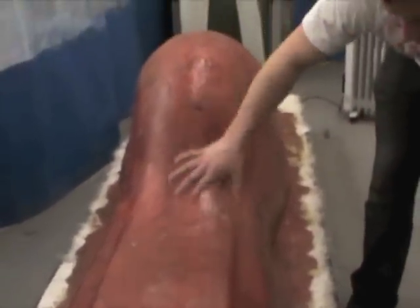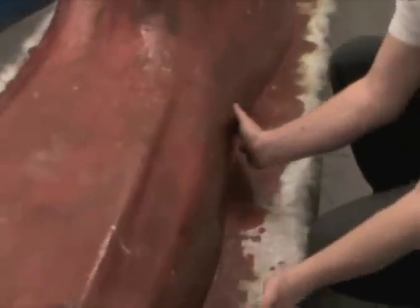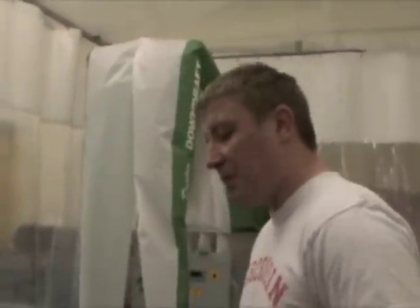Overall, it houses the driver, the wheels are going to be external, and there are slight indentations which allow for the wheel to actually turn. We ran CFD — computational fluid dynamic testing — on the SolidWorks models, and according to our results they are extremely efficient, giving us an extremely aerodynamic body. We are expected to lay carbon in about two weeks. It'll be the first time we've ever vacuum bagged such a large and deep piece, so that's something we'll be carefully working through in terms of process.